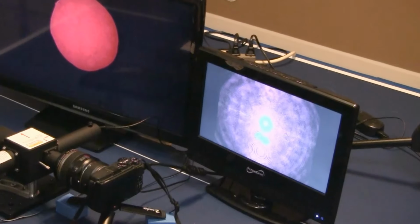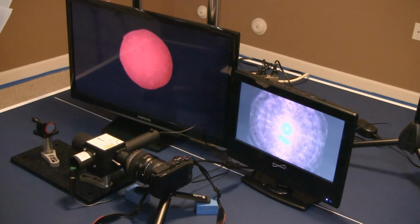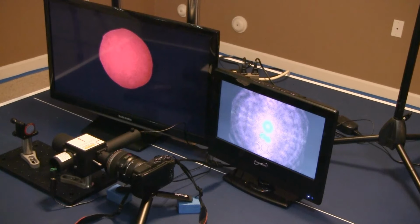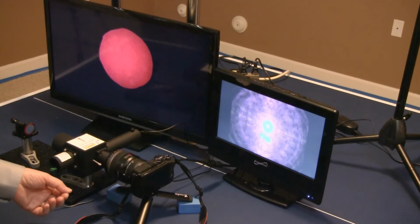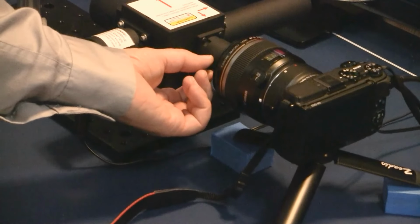When the point spread function is small and precisely centered on the pinhole aperture, the amount of light passing through the pinhole aperture will be maximized. The light which passes through the pinhole aperture will diverge in a pure spherical wavefront, which constitutes the SPPDI internal reference beam. The reference beam will be mixed with the unmodified signal beam, which passes through the SPPDI, thus giving rise to interference fringes, which indicate the shape of the test mirror. When the intensity of the reference beam has been maximized, polarizer number 1 may be rotated away from the beam blocking position and the signal beam adjusted for proper intensity.